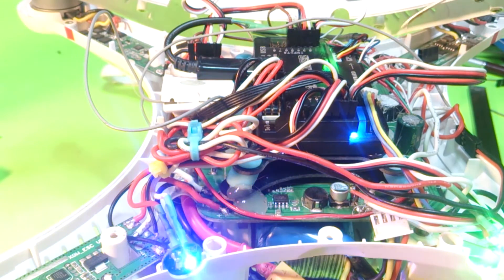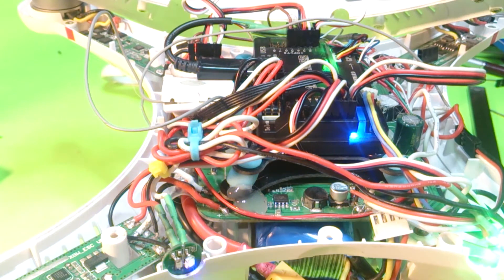I would go one step further and try it in each port: try number one and number three, then try number two and number three, then number four and number three — and just confirm that every motor starts beeping and the one you had problems with stops. Because at that point, the only thing left would be the APM. Somebody on YouTube today asked me about changing the outputs, and I finally got un-lazy and decided to do it.